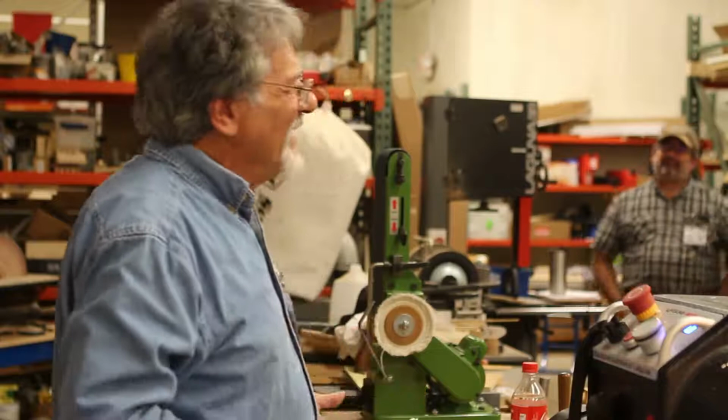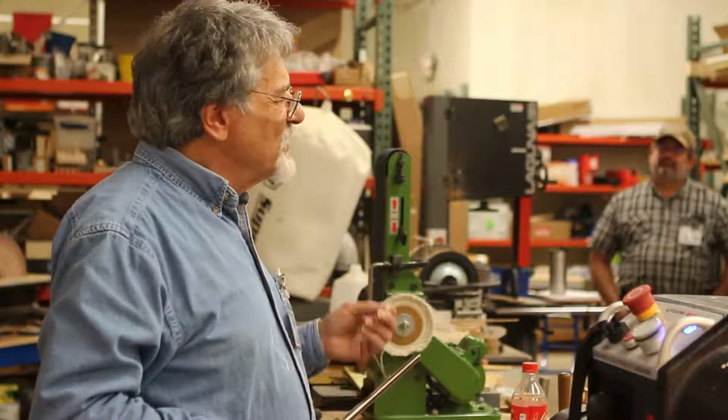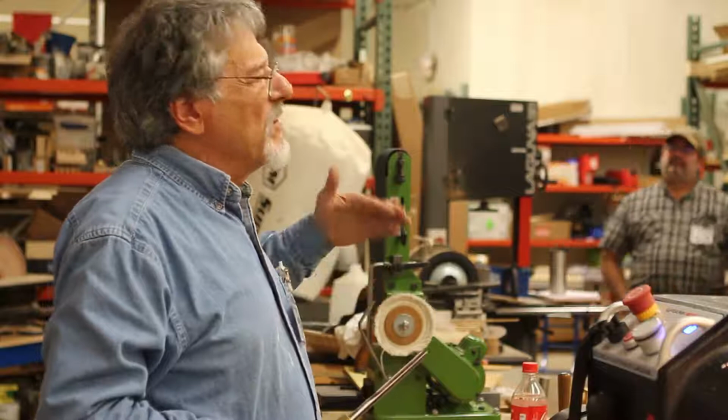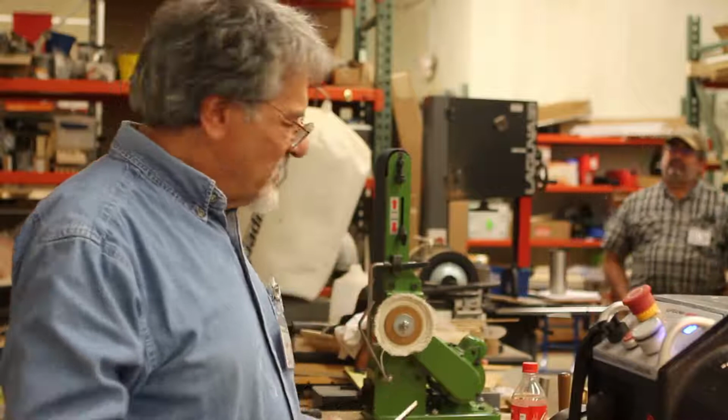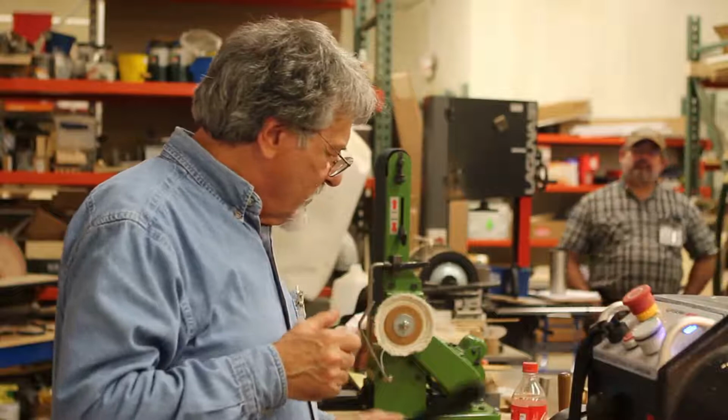But if you're turning a very soft wood, or pine, and you really are trying to get finishing cuts, then I think deburring does produce an edge that's smoother and more consistent than allowing the burr to just break off on its own, which I think leaves an edge that's a little more ragged and not as consistent. Okay. Next thing we want to do is, I could do this with a 3/8 gouge or half inch gouge. Well, maybe I'll do a little bit of both.